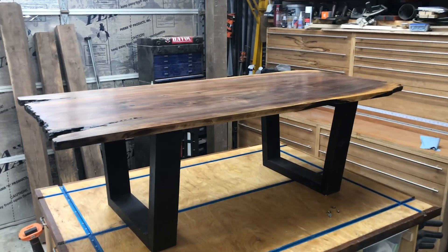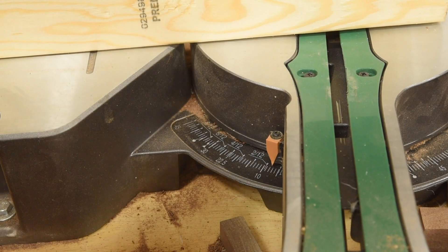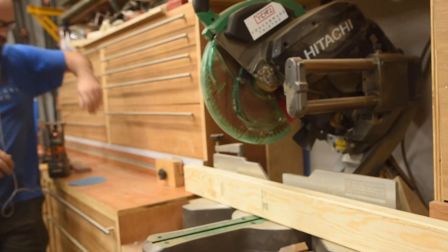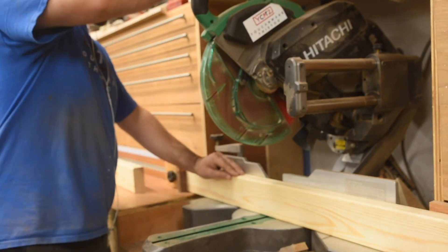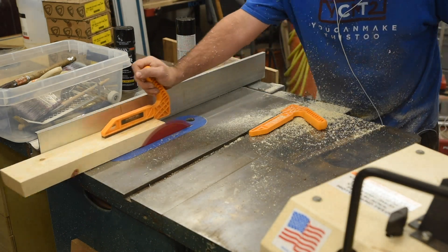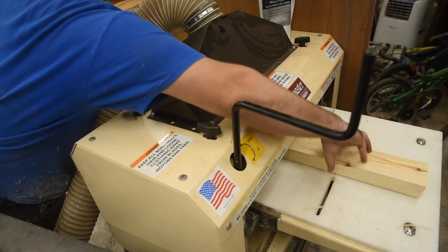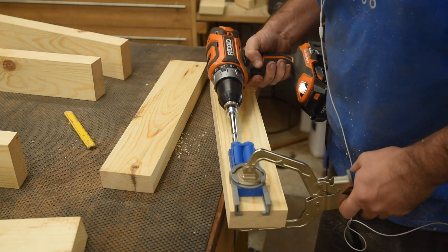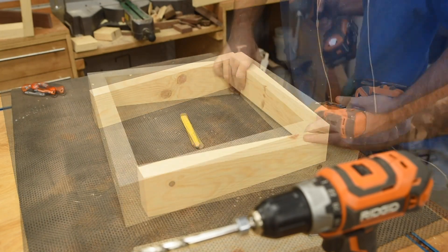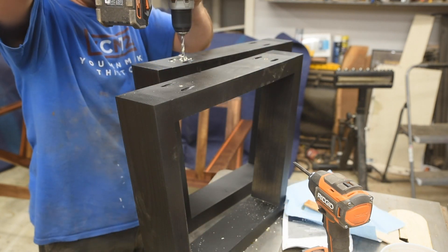I had a craft fair that I wanted to bring the coffee table to before the base was finished, so I whipped this one up as a quick temporary. It took about two hours, and I left this in here just to show you how simple a coffee table base can be. I cut all of my pieces to 7 degrees — nailing the angle isn't important, so long as you don't adjust the saw and everything gets cut the same. A stop block makes sure all the pieces were cut to the same size. I generally avoid using 2x4s for furniture, but when I do, I knock off the rounded corners at the table saw. 2x4s really aren't very flat, so I sent them through the planer as well to get some flat faces and take off some of the thickness. Pocket holes made these go so quick for the joinery, placed on pieces that would go against the floor and table so they won't be seen. Off-camera, I sprayed them with some rattle can black lacquer before drilling holes for mounting screws. The quick simple bases are done.